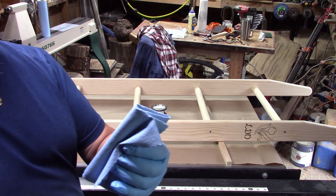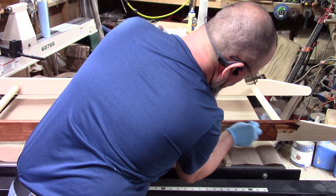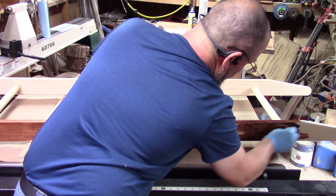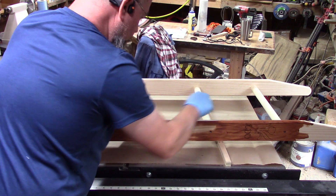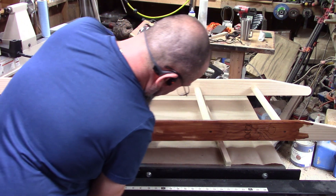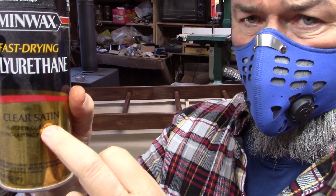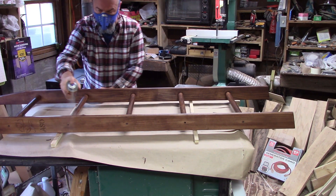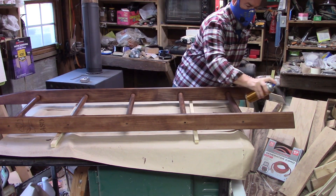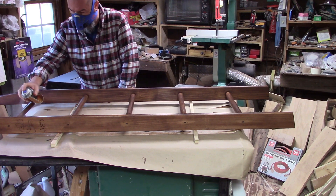Here I put my first coat of stain, which was American Walnut Stain. It turned out it was actually too light, so I went back and used a dark walnut after — I didn't actually get that in the video. Here I am staining — I'll put stain over one upright and then come back with a clean paper towel and wipe it off to get it smoothed out so it doesn't look as blotchy. You can see the stencils really show through it. Now I'm getting ready to spray my first coat of satin polyurethane — I didn't want any real shine on this; I wanted it to look kind of old, sort of. That's why I'm using the satin.